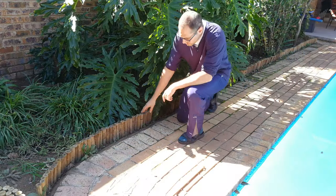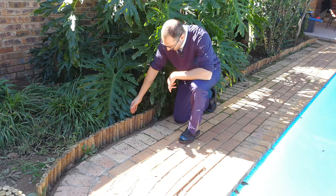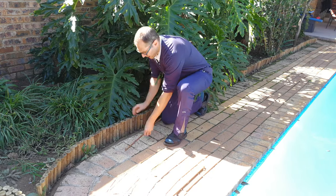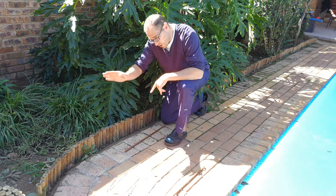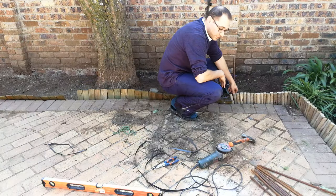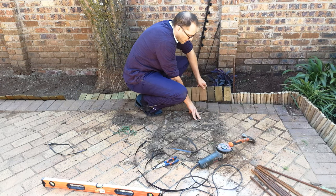This is an earlier job and you can see these are the same round log rolls, not in the ground - they've just been placed here. We have attached these rods just to support it; we've inserted these rods every half a meter or even more, hit them into the ground, and you can see how this is actually really strong - it's not moving anywhere. We are going to do the same over here with the round log roll and then carry on with the square edging.